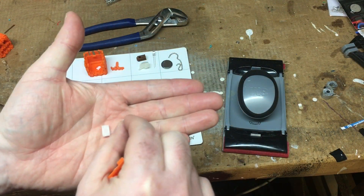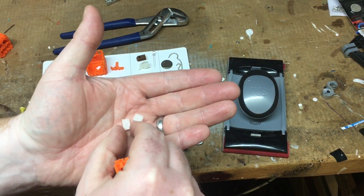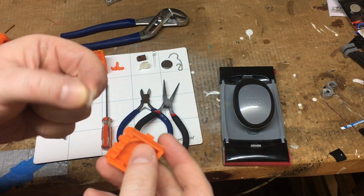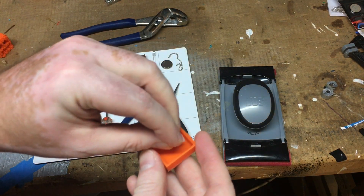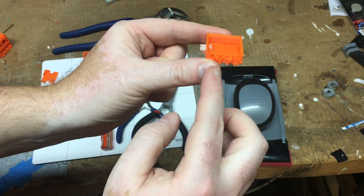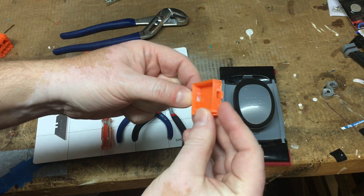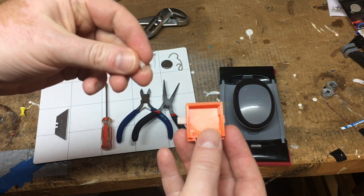The two buttons are printed in glow-in-the-dark PLA. One of them is longer than the other by design, and you're going to want to sand these down a bit, because not all printers are the same and you want to get it just right. Put the longer of the two buttons on the left side as the pumpkin is facing you. The buttons have a little lip on the inside on the top — that's what keeps the button from going through. They should be flush. Now let's put the shorter one on the other side.